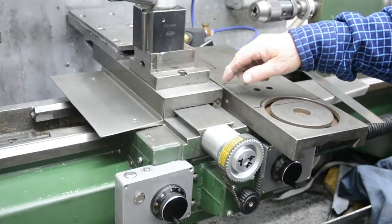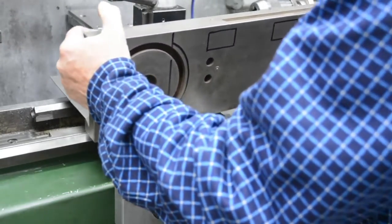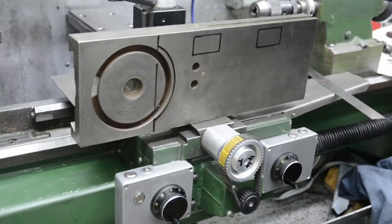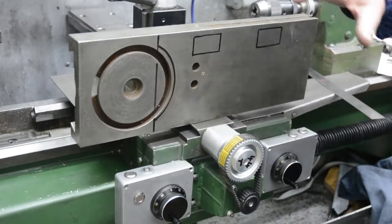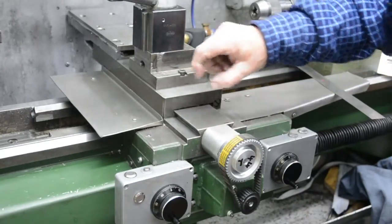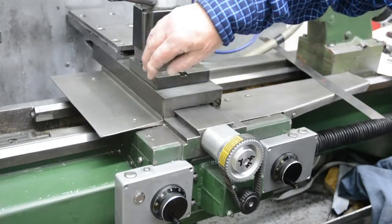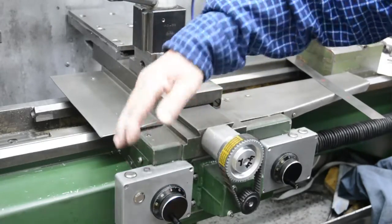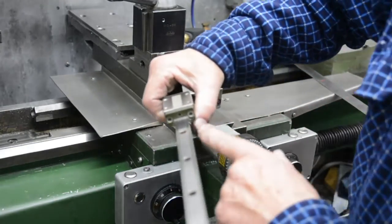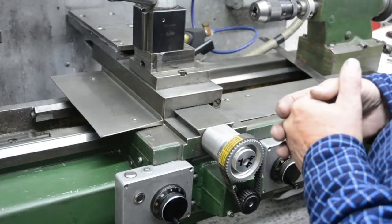My original idea was to simply get a large lump of steel, but I had this old cross slide, so I thought I'd use this first of all. It's cast iron and it's heavy as hell. If everything works out okay, then I'll probably get that steel plate and machine that up. The advantage of the steel plate over this will be that it can be a little bit deeper, so I can mill it with a thin piece on the side here, which will divert any swarf and oil away from the slides — although the slides do have seals, or wipers, which will get rid of swarf. Probably it's, as you can see, a pretty easy conversion all round.